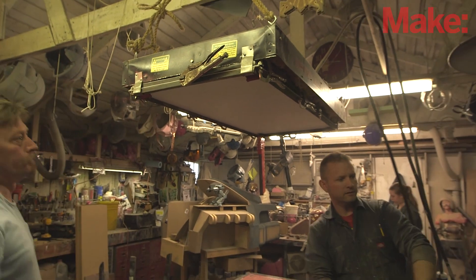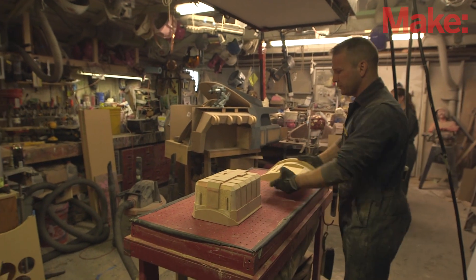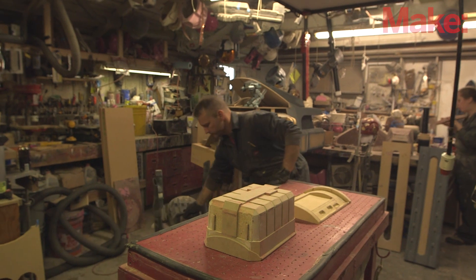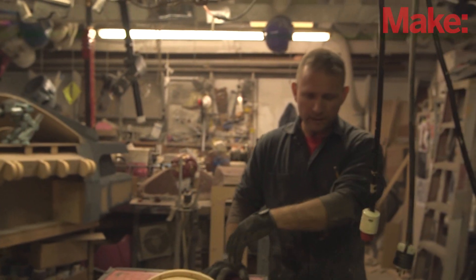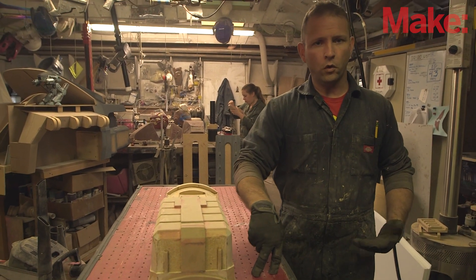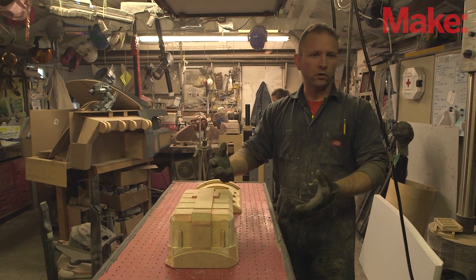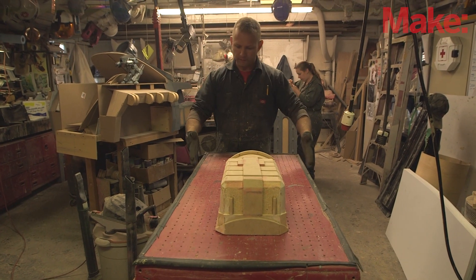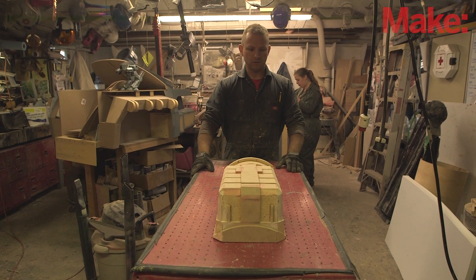I'm going to take a couple of forming bucks — this one's exceptionally deep so it might be a bit of a challenge. The forming table itself is basically like an air hockey table that works backwards. I've got a grid where every inch there's a hole that's an eighth of an inch in diameter, the whole box is hollow, and on the bottom there are flanges where all the suction gets ported into the box. Once the plastic frame is pulled down it'll move outside of the rubber gasket edge, pulling everything tight — once we've got a nice seal on the edge it should happen pretty quick.